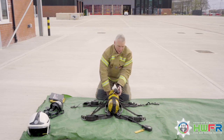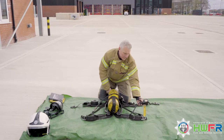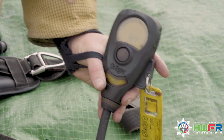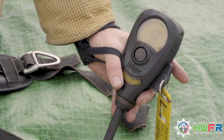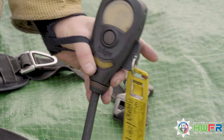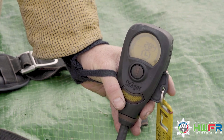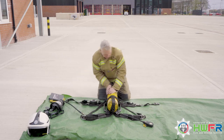Press the reset button, hold, and turn the set fully on. Observe the bodyguard: one cylinder is shown at 6.8 litres of water and an arrow pointing to the left requests a leak test, which we then press. Fully turn the cylinder off. An arrow pointing to the right appears and we press the right-hand button. The bodyguard will now undertake its leak test, displaying a clock along with 280 bar pressure. Pressure is always rounded down to the nearest 10 bar.